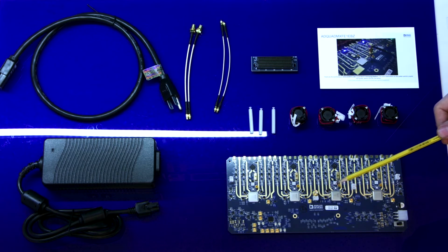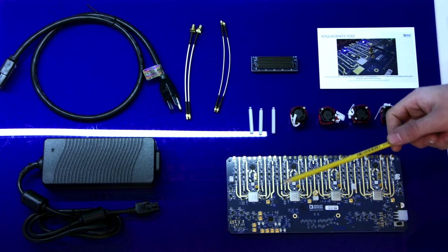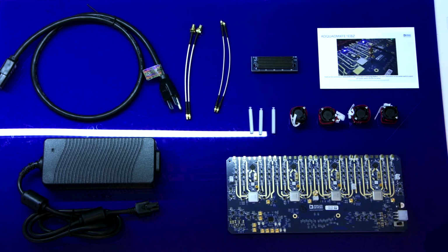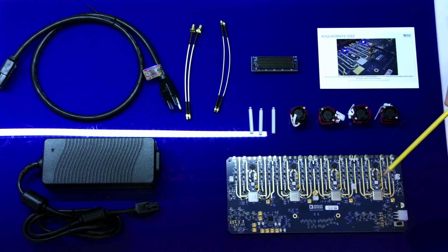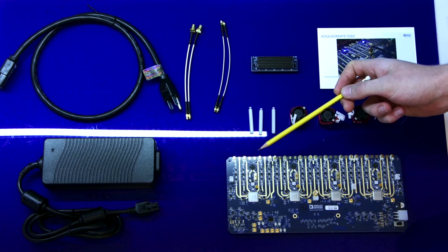This includes 4 ADF4371 PLLs to generate the sample clock to each MxFE, and an HMC7043 to distribute reference clocks and JESD sysref signals. An RF front-end design for the frequency band 2.7 GHz to 3.7 GHz, including amplification, filtering, and digital step attenuation for the RX path. However, other variants of the board change the frequency band.